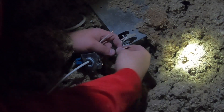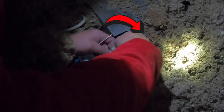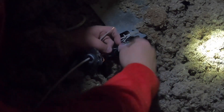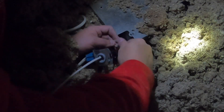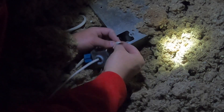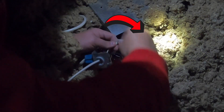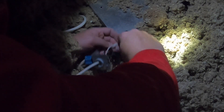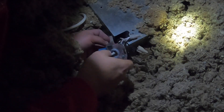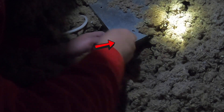The black needs to go to the black - go ahead and spin this wire nut off, then spin it on just like so. You want to make sure these are really tight and they will begin to twist and tighten down on themselves and each other. Then get the white one on there the same way - you want to get them all to where they are the same height and just begin to spin. You're just tightening them down, making sure no copper is able to be seen. They should slowly start to tighten down on each other.